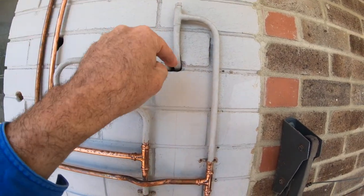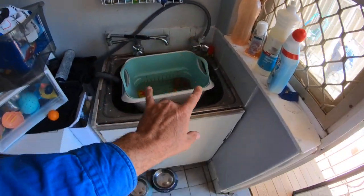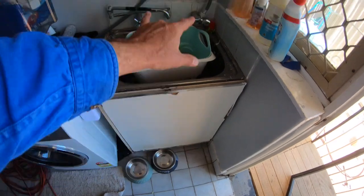That's a sign that it's going down into the wall, and this is just on the laundry side. So the pipes probably come down here and then go under the floor — that's what I reckoned when I came out. So I made the owners aware. I said, look, it's probably a good chance that all the water pipes are under the slab. You're spending all this money on a new bathroom, and if you don't get rid of them and rerun them, it'd be a world of pain later.